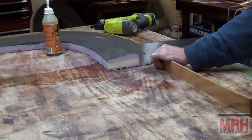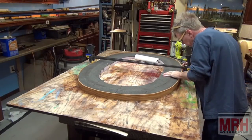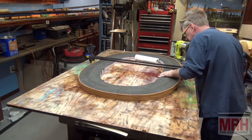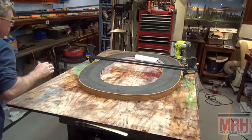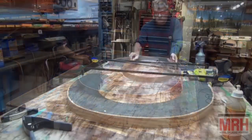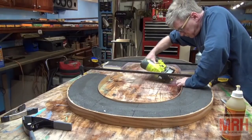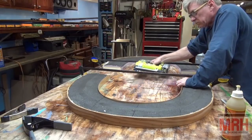After cutting the plywood flush with the ends of the layout, I quickly set up bar clamps to hold the layout together, as the plywood's tension wants to pull the U sections of foam wider, up to an inch. So the bar clamps prevent this. The plywood's tension stops as soon as the glue cures, keeping everything dimensionally stable. I repeated the same process to wrap the insides of the layout with wood, this time using 1/16 inch strip oak plywood cut into 2-inch long strips.